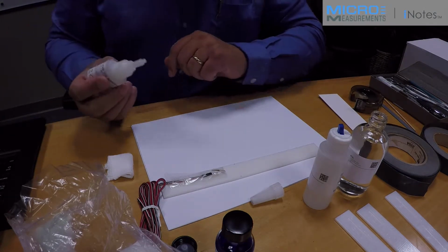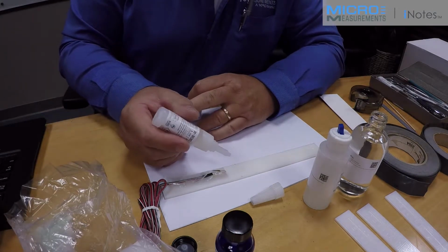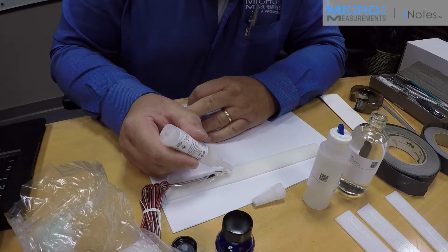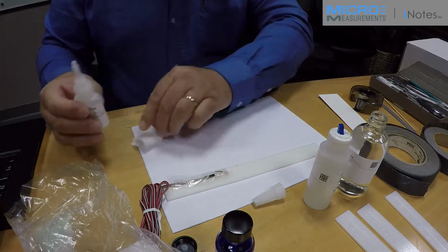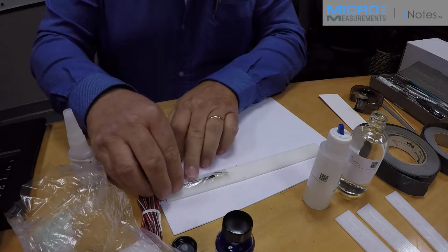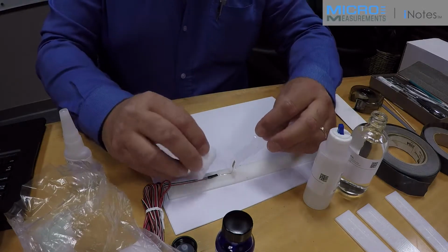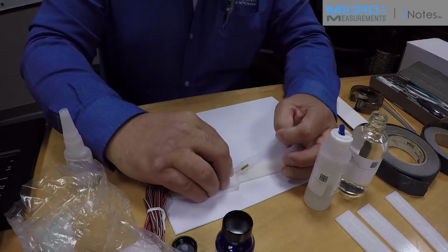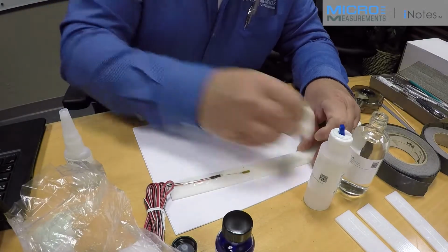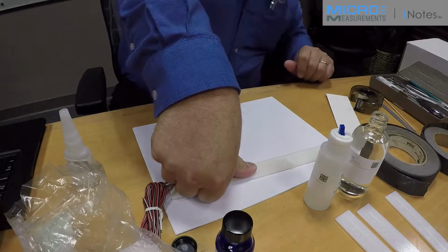Now I'm going to place a drop of adhesive on the beam in line with the strain gauge but outside of the strain gauge site. I'm going to use my tape to hinge the gauge back over in place and use a gauze sponge to squeegee that to create a very thin glue line. And then I'm going to apply my thumb as a mechanical clamp for 1 minute.